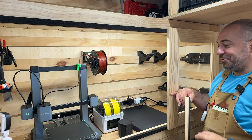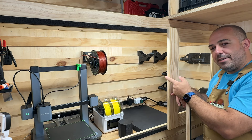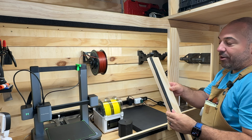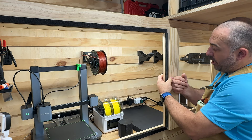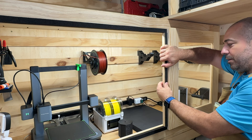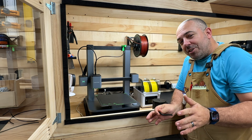The new thick seal is on and it's really thick — very happy with that. When the doors come together there's always going to be a crack the entire way that lets air in and out, so I repurposed some of the thinner weather stripping I'd removed and put it on a board. That board gets screwed to one door so when the other one closes — which means this one always has to close first — it pushes onto this weather stripping and makes a tight seal.